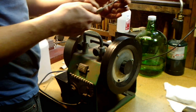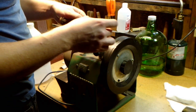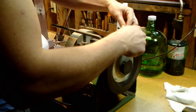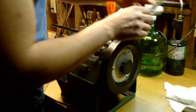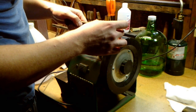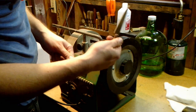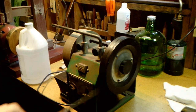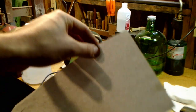After stropping, wipe it off. I have a little bit of oil on there to help lubricate it. Take your fingernail and ride it on the cutting edge - feels pretty good. I've got a little burr right in the middle still, so I'll polish it just a second more. Now it feels pretty good - my fingernail is not catching anywhere, it's nice and smooth. We call that fully sharpened. I'll show you a fun little test to ensure you got a good edge.